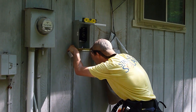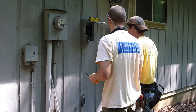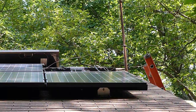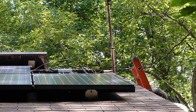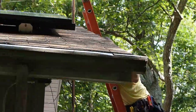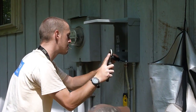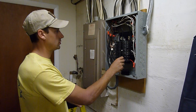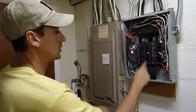This is the disconnect box to disconnect us from the electrical circuit and the rest of the world. They removed one of the panels on the roof to make the connections, and he's feeding wires through right now. This is your interconnect breaker — it's a 2-pole 20 — combining all the circuits on the roof so we can come into the house with just one breaker.